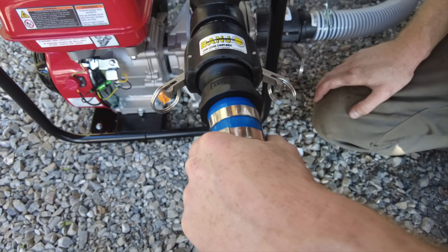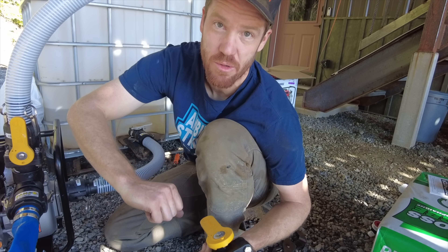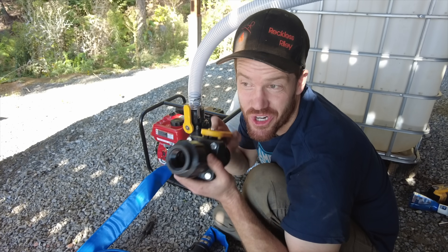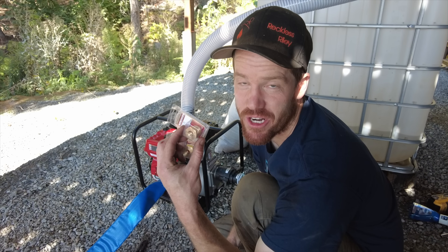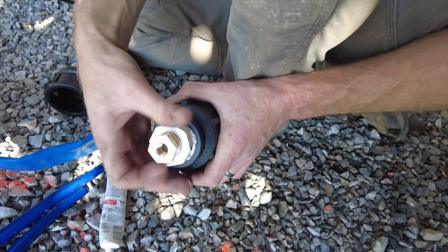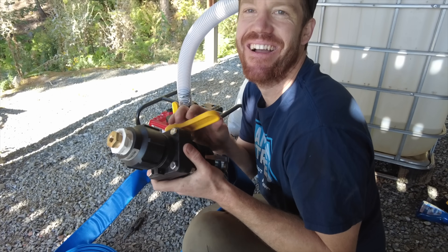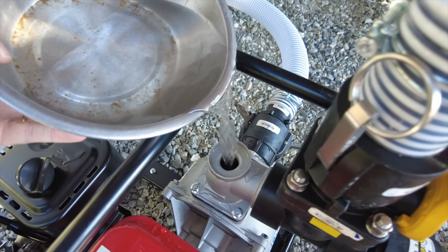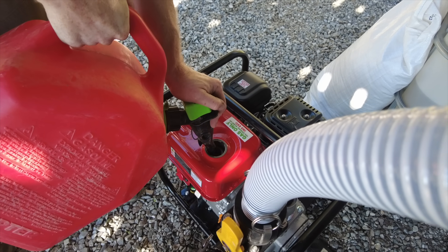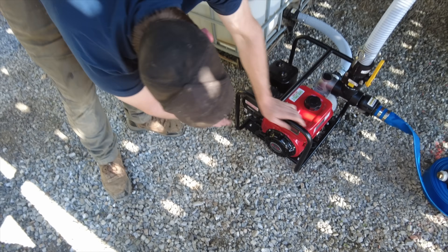Now this hose hooks up here. It's time to build our nozzle assembly, starting with a valve. This valve is going to allow us to turn our spray off and on as we're using the hydroseeder. This hole is much too big to spray out of as a nozzle, so first we're going to add a reducer, and then I got a variety of brass fittings to try as spray nozzles to see what works best. They did say we need to prime the pump, so I'm going to do that really quick. Our spray nozzle is closed, our jet nozzle is open, our loop is hooked up. I think we're ready — let's fire it up. Choke on, and here we go.